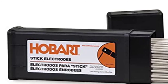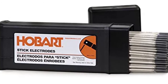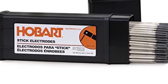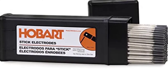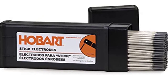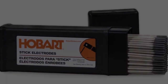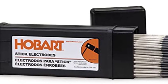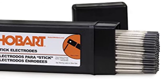The 7018 electrode is an exciting addition to the product line. This low-hydrogen electrode can be used in all positions on low, medium, and high-carbon steels. With its high tensile strength and ability to run on AC or DCEP reverse polarity, this electrode will make your welding job easier than ever. A low-hydrogen electrode for use in all positions on all types of sheet and plate steel. The electrode works on both AC and DC polarity, so you can choose the method of operation that best suits your shop.